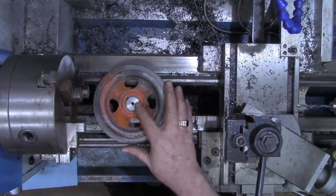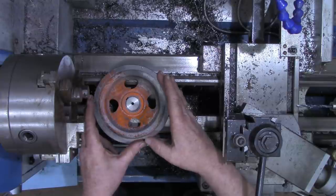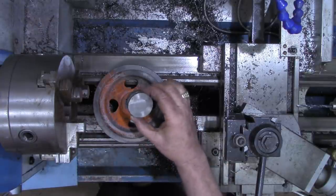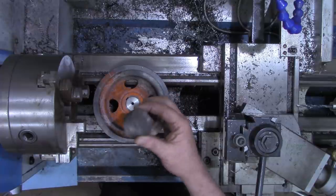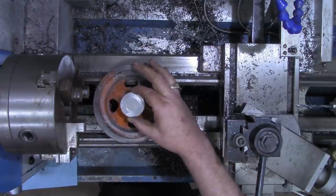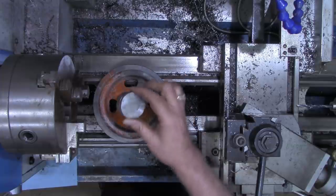Alright, I've got the center piece pressed into our pulley now, which is going to be the bottom part of our mold. The next thing we need to do is work on this piece - this die here. This again is a piece of scrap that's going to be the die. That will set over the pulley with the sheet metal sandwiched in between and pressed down.